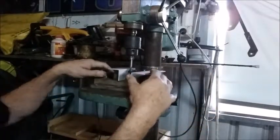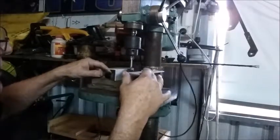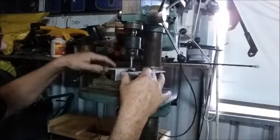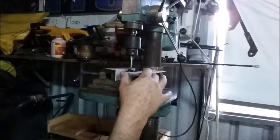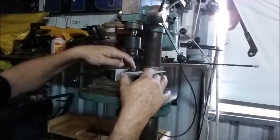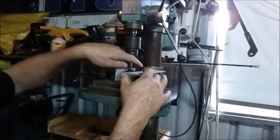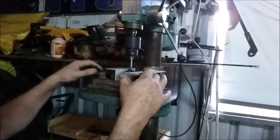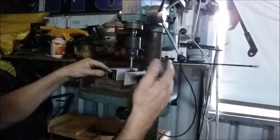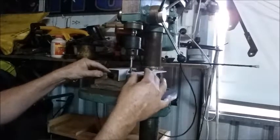So we can cut through. We can follow our dog around, just backwards and forwards, until it touches the top of the dog. And then the only thing that will really happen is we'll have to get the verniers on, and measure the top of our new dog and the back of it to make sure they're exactly the same size. And then we'll know that everything's as it should be. So we'll give that a go and see what it looks like.